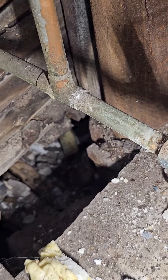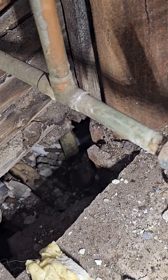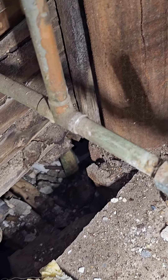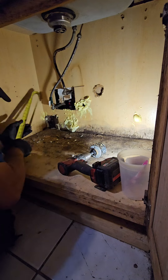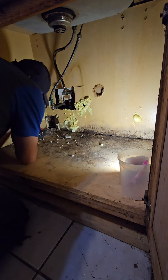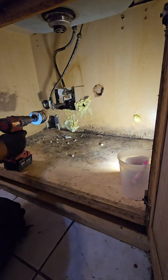When I look to my right I see the vent stack — it's all cracked, the hub is missing a chunk, and the pipe is all cracked going up vertically. The landlord is not going to fix this until people start complaining about sewer smell, but they're not because everything already stinks.